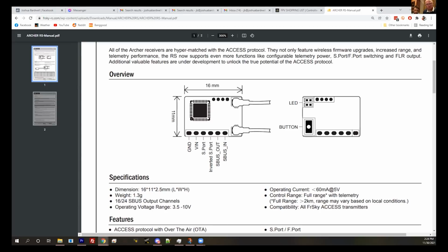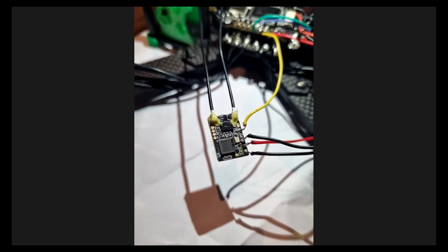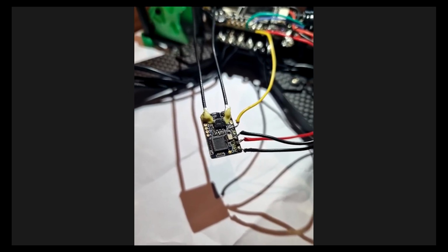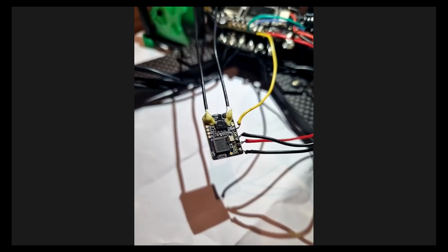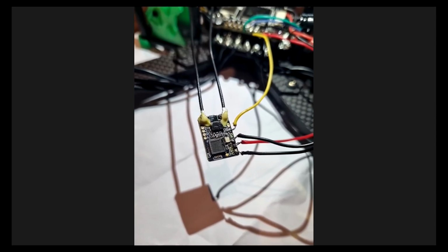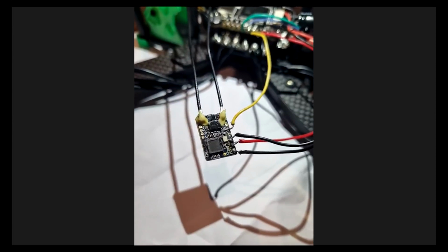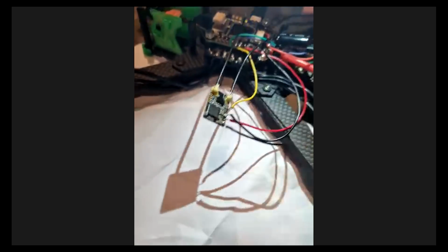And then, is there any chance that I could see that? It looks to me like that S-Bus wire perhaps is hanging over the pad enough that it might or might not be touching something. I don't know for sure. The yellow one, is that the one you mean? Yeah. It's in the right position for sure. I don't know if you can see whether it's touching any other components. It's not the best, but it probably is working as long as it's not touching anything else. Well, there's no bits of metal sticking up underneath it. So okay, we'll let that pass for now.